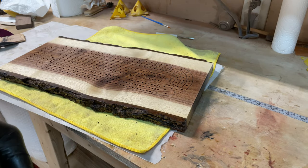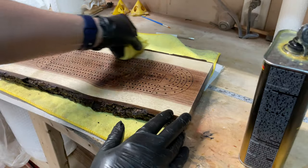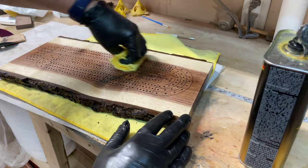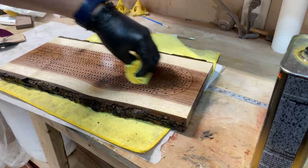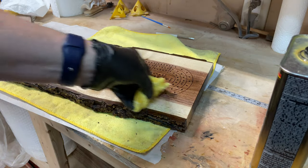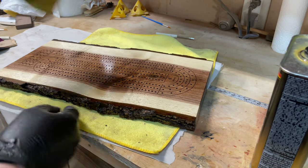The last thing to do is put on the final polyurethane coating. I'm using wipe-on poly again and it works really well. It's a satin finish so it doesn't give you that really glossy look — you can get it in gloss, but I prefer not to have it too shiny. I'm just rubbing it on and I'll put three to four coats on. It's very thin so you'll never get brush lines or blobs. I'll also do the bark on the sides with this.